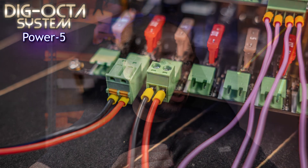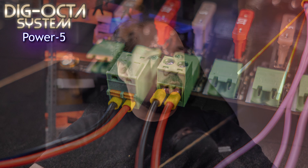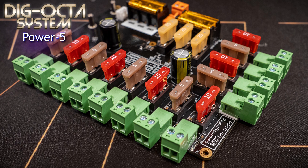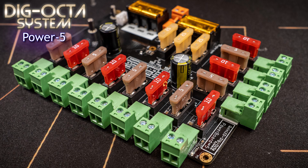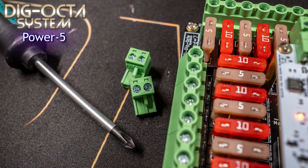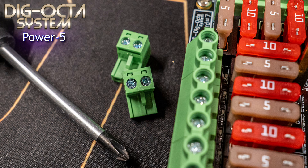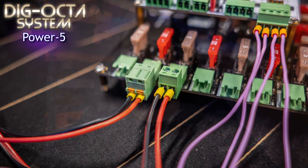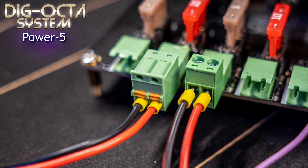Now let's take a look at what makes them unique, starting with the Power 5. The Power 5 was designed with stacking in mind. It uses a traditional setup where the positive and negative are together on a single plug, and it has 12 output ports — eight on the front and four on the right side when looking from the front. These plugs are pluggable 5.08 mm phoenix-style connectors and come delivered with the male end to which you attach your wires and then plug into the board. Everything in the system uses plus-type or Phillips head screws, though flat head or screwless styles are available separately.